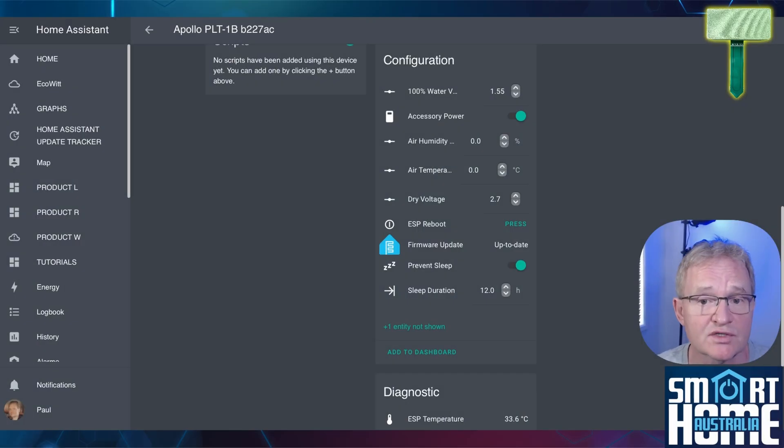The PLT1 battery soil sensor runs on a large 18650 battery and connects via Wi-Fi, which is notorious for draining batteries — hence why most such sensors run on Zigbee or Bluetooth. The sensor is rated at six months on a single charge, but to achieve this you need to configure the sensor to sip on power. Increasing the sleep duration is the most effective way: the default is 12 hours, but setting it to 24 hours could potentially give close to 12 months of battery life. And don't forget, you can always just plug it into USB — but then again, why did you buy the battery variant?